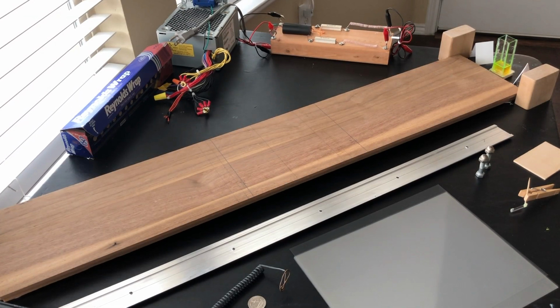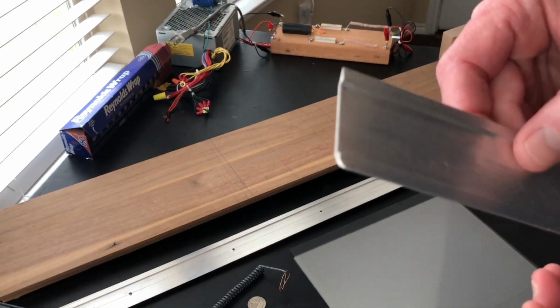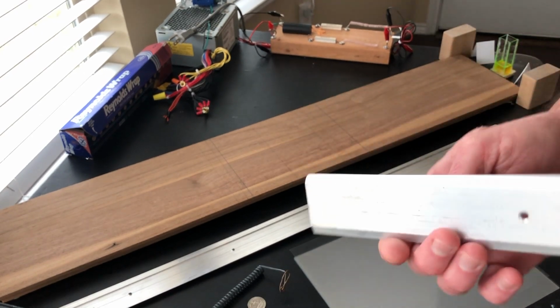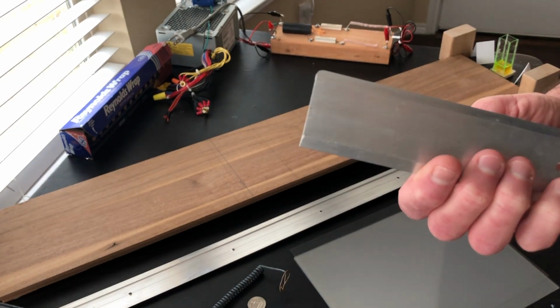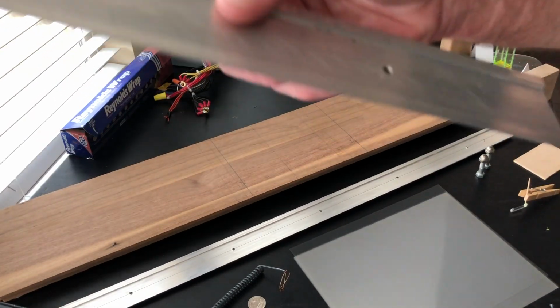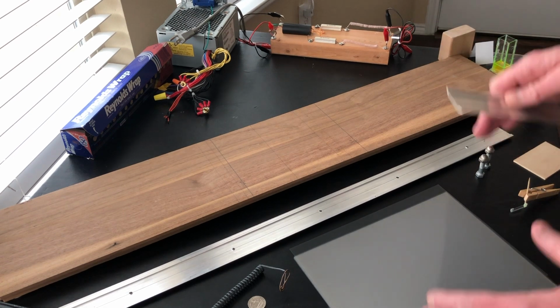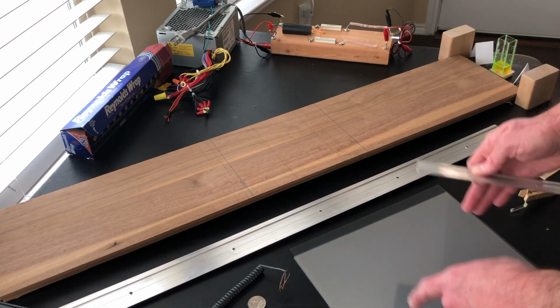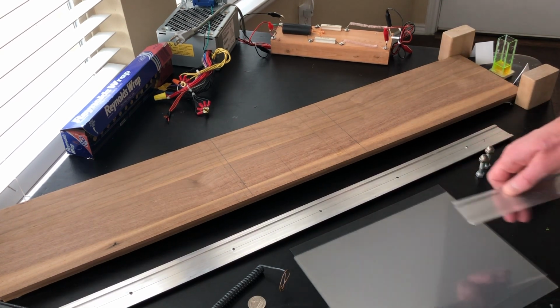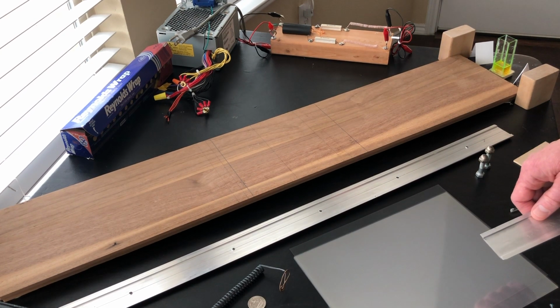Okay, I'm going to show how easy this laser is to construct. Now, this is the saddle threshold that you're going to use for the laser electrodes and for the actual capacitor. See, the width of these and the length of them defines the area, which then in turn defines the actual capacitance based upon the physical area of the plates, the thickness of the dielectric, and the dielectric constant. I think I measured these at like 4.2 nanofarads.